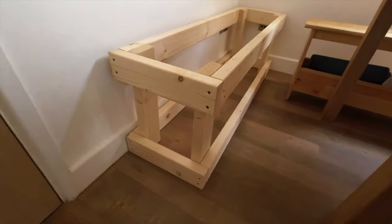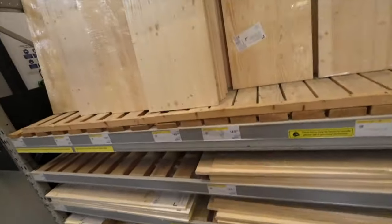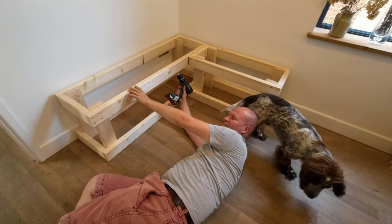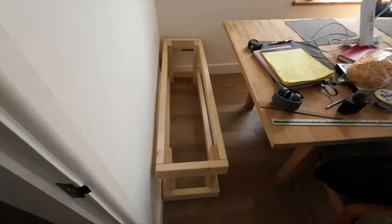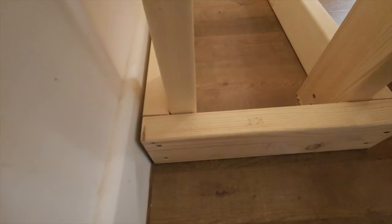I started this - here's what it looks like at the moment. The frame of the first part of the L is going okay, but I didn't know it would end up this way so that's why I didn't film it - I was kind of working it out as I went along. These are my calculations here. I know the bench bit that you sit on is going to be 40 centimeters wide, so everything else has been worked backwards from that. It looks like extreme woodwork but it's actually extreme mathematics - I've just done about four hours of maths working back from a top of 40 centimeters all the way to the wall. The walls aren't straight and I forgot about the skirting board, so I had to factor in the gap from the wall caused by the skirting board.